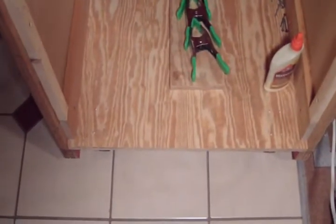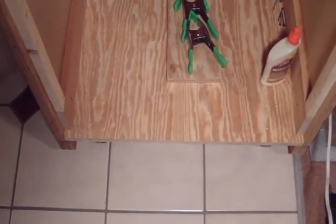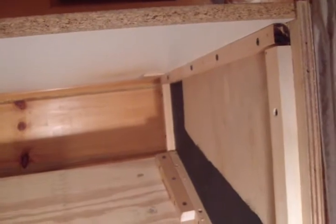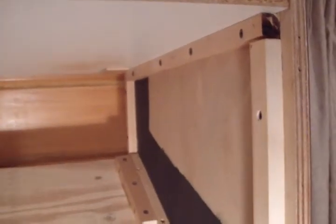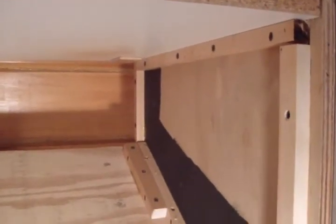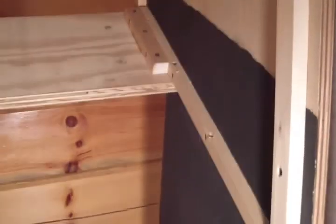I've tested it with the large 5-foot panel that I have in the next room. It's the big removable panel that I'm going to put on the back of this. Now we're still going to have a smaller panel at the bottom, maybe 8 to 10 inches, and one at the top. And I'm going to put those in to just square up the cabinet, and they're going to be installed permanently. And they'll not be removable at all. So they'll be glued in place and probably either screwed or nailed in place. And like I say, that'll be maybe 8 to 10 inches coming down. It may be a little more on this top panel.